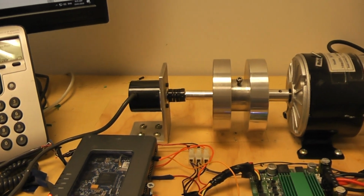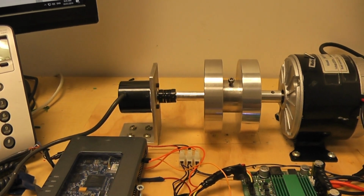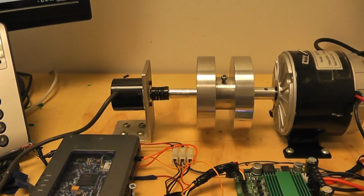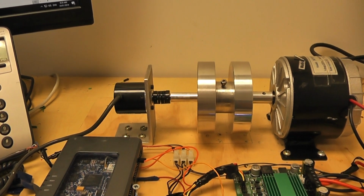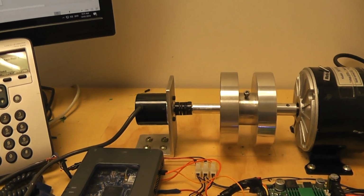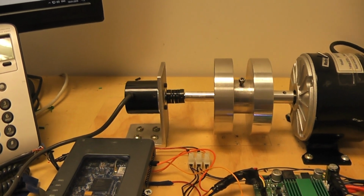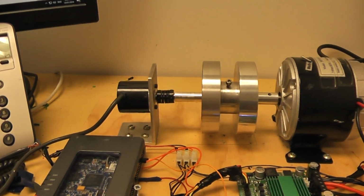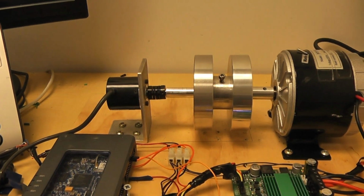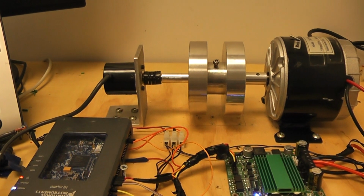So what I've done instead is I've just designed a position controller where I've put very high gain into it, and two integrators. One of the integrators is already there. It's a mechanical integrator, which is caused just by measuring. If you measure position, that gives you an integrator, really, just like with a potentiometer. You've got a 1/s term in the loop, so it's the same thing. So I've got that, and because it's a type 2 system, I've got two integrators. It means I can follow a ramp very easily.